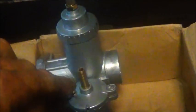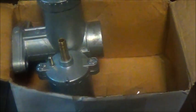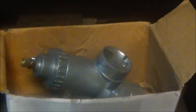It's got the button on it you push, and you know, they joke about or talk about tickling the carburetor, but you push the button and it actually lets the fuel flood run over, and that's your choke basically. And pretty neat design, old design, and that's why I liked it. So that's what we're going to run on it. And you know, I normally don't ever buy a new carburetor, but this thing was $30, so you know, cheap as you're going to find, I guess.